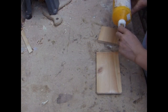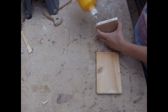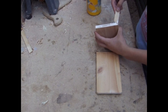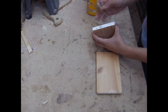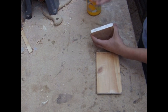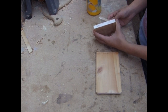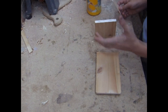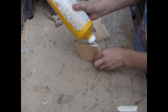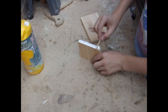To get started with the glue-up, I'm applying some glue to the end grain of this part first — I want a good amount on there and I'll spread it out using a small scrap of wood. I'm going to let that sit for a little while to let the end grain soak it all up. Just like straws, the end grain is going to suck that glue in, so if you try to glue it together right away the joint will be relatively weak. After a few minutes, I apply another bead of glue, spread it out, and then clamp them up.